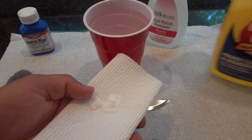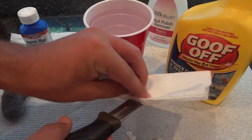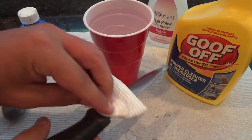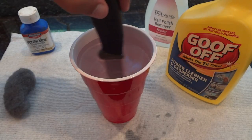You don't want any oil or dirt on it, as this will affect the cold blue. If your metal isn't perfectly clean and has a little rust, you want to remove that before you start the bluing process. After that, rinse in water and then dry.